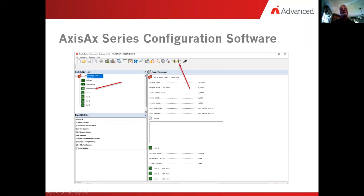And this is how we tell an amplifier not just to turn on. Think of it like a jukebox. The jukebox is turned on, but you have to select what record to play and which side of the record you want it to play. Same idea. And then beyond that we have the cause and effect output groups. That's how we're going to tell it when to activate. Not every alarm is going to make it activate because we're doing a selective signal three floor building.